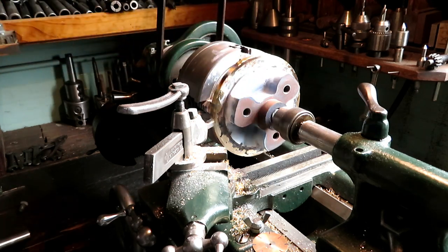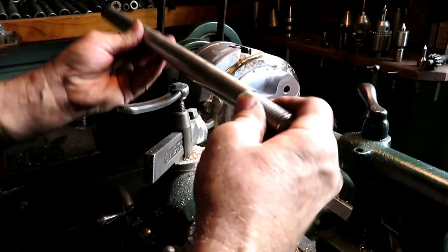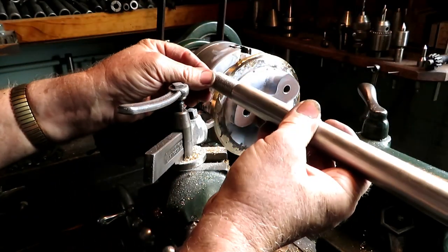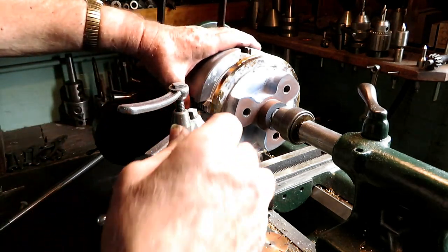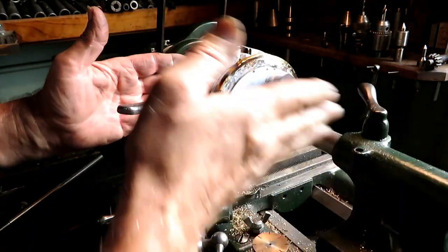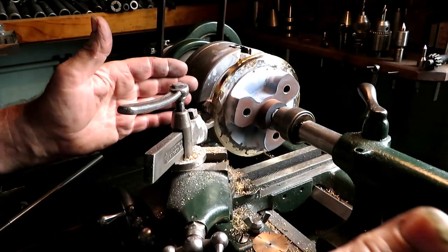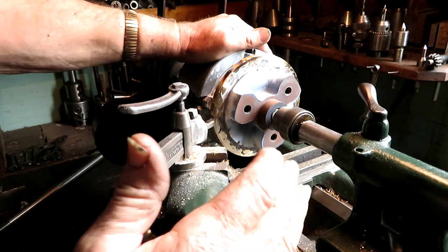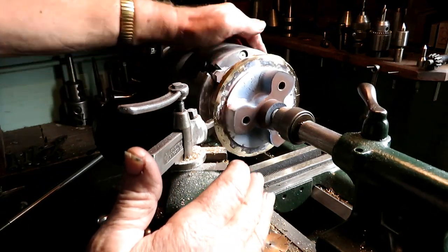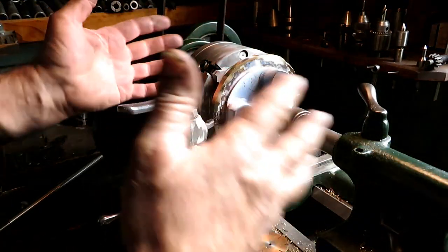And put a center hole in here and set the whole thing up between centers on the other lathe, and then machine this so that everything will be perfectly straight and concentric with the piston and the connecting rod. That's how they did it in the locomotive shops. When they did any work on a piston, it was complete with the rod and everything was straight that way.